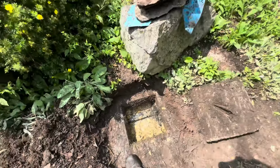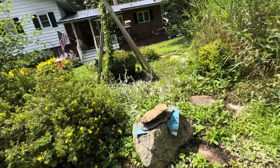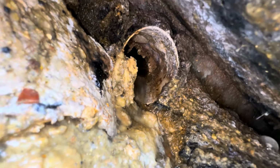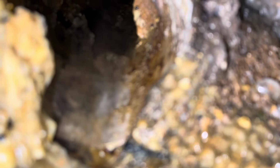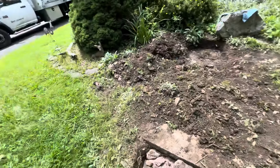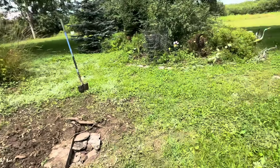But first we'll get the septic tank pumped out, get the leach field end corrected, and drag the material out of the pipe that's going to be collecting along the top and sticking to the top of the pipe and hardening due to a leach field issue. This pumped out. Tech has covered up the outlet situation with some larger voided rocks. That way it works for them until they decide what type of leach field they'd like to have repaired or installed, found, etc.